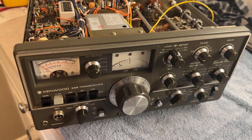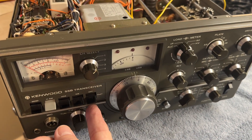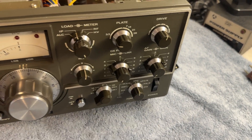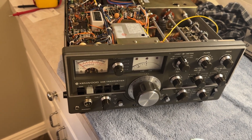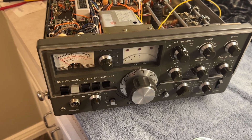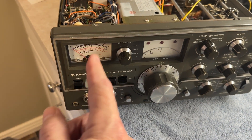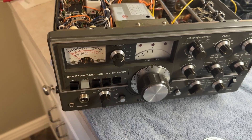If you've got a 520, put it on fast and turn the RF gain up a bit. It's not going to slam the meter, but it's probably going to almost peg it — in this case it almost pegged it. Just turn up the RF gain a bit; you can off-tune. I like the meter about halfway to three-quarters, so if you off-tune it'll obviously start dropping, and then I can kind of look at it.